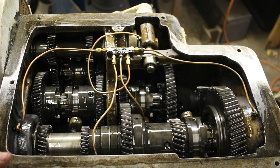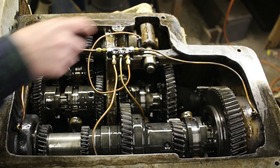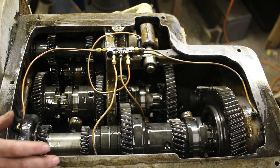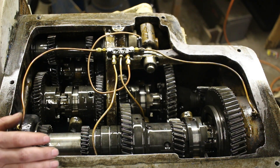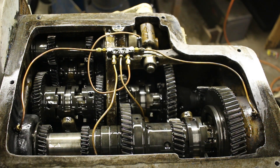I'm finally ready to put the lid on this thing and start working on getting the clutch fixed. I've got 7 quarts of SAE 30 in here - that's what it's said to use, 30 weight oil. I checked to see that the pump works, and oil comes out. I had replaced these metering valves before I started, but with the amount of sludge in the bottom I figured they could have been plugged up again, but they were all okay. I've got everything safety wired, the pins are safety wired in - it's not the neatest job but it should be fine. All the set screws are tight, all the rings are set. All the shifters work and they all engage properly.